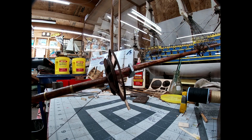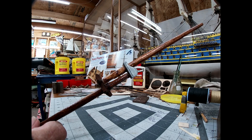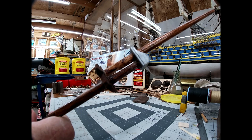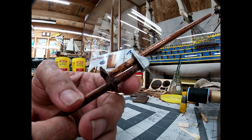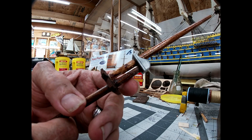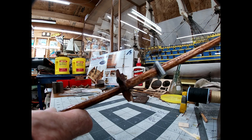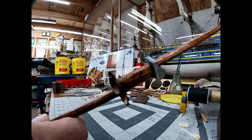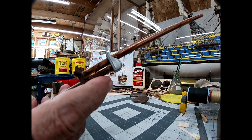We got the crow's nest and all the brackets and everything shaped. The hole in this pewter block for this piece of pole here was too far out because they want more separation between the two poles, but the base piece doesn't let you have that much separation the way it's built, so I had to modify the base piece to fit the poles and definitely change the shape of the ends of both pieces.